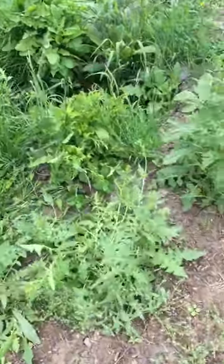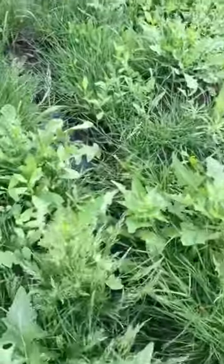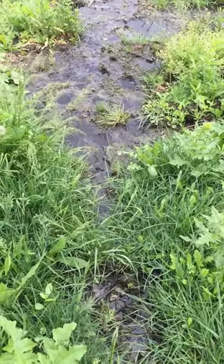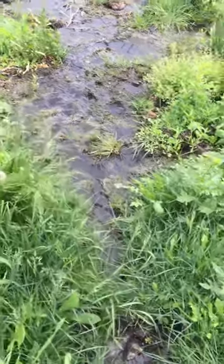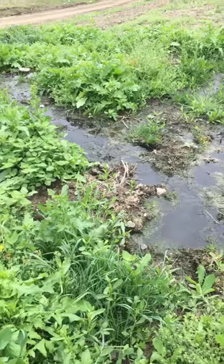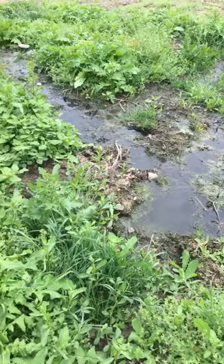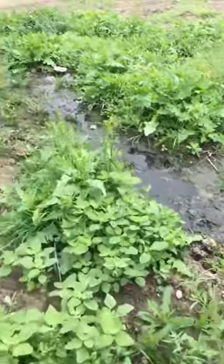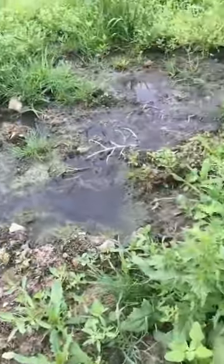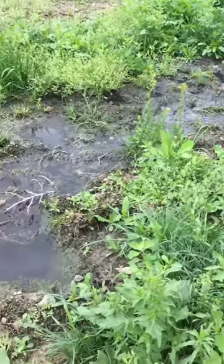Now as we make our way down from the distribution box, we check our trench overflow again. As we can see, there is no more water trickle — the water has stopped and is now settling, and this wastewater is going to be absorbed into the soil. Our next order of business is to bring a little sand over top of this area to ensure it doesn't continue to run down the bank, and then some topsoil over top to ensure it stays safe.